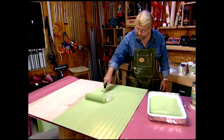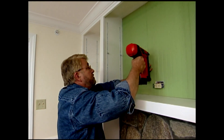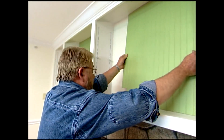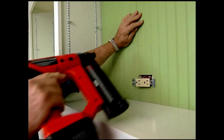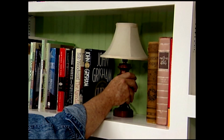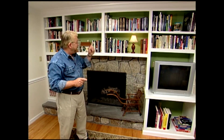With the color selection made, I get to work painting the beadboard, which I've cut to size. To attach the panels, I'm using just a few small brads, nailing mostly around the edges. This way, I have fewer nail holes to fill and an easier time removing the panels if, later on, I want to go for a different look. I really like the way this looks — it's added a nice accent to the room, and I'm really glad I did the color samples because I think we picked a really good one. And if I get tired of this, I can just pop those panels out.